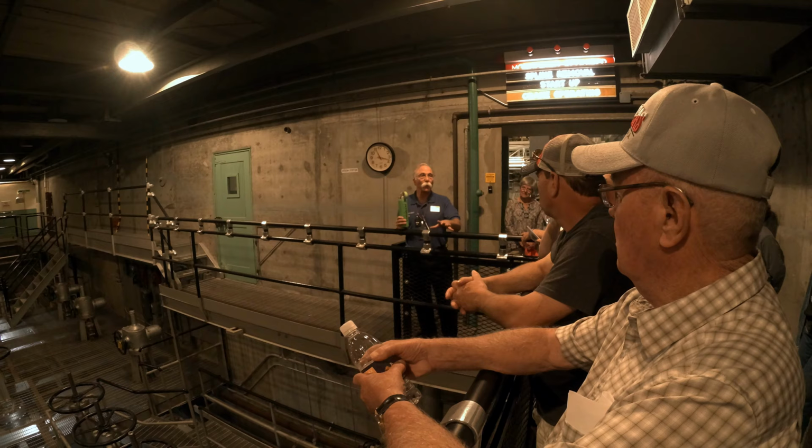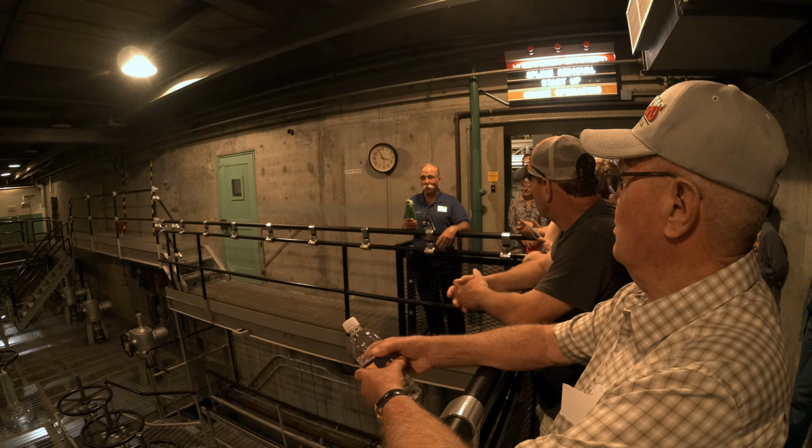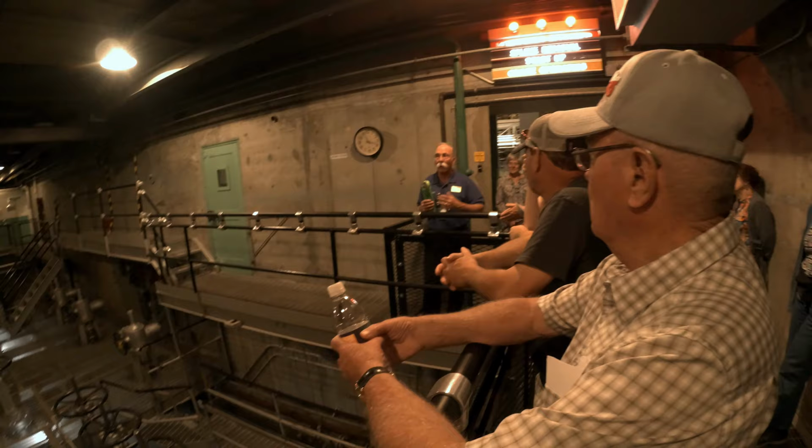But you're probably thinking, well, if you needed 50,000 gallons a minute, roughly, and there's 500,000 gallons, that's 10 minutes of water. You're telling me that's a safety system? But let's remember, you only need 6% of that flow to cool that decay heat. So now when you do the math, there's several hours of water trapped in those tanks. Now the question is, well, what happens if you run out of water?